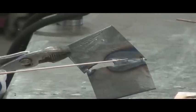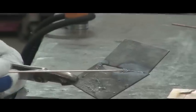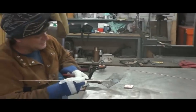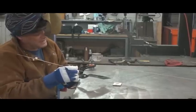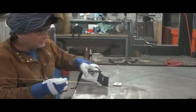See, I can start to fill this hole in here. And if you look on the back side, you can see it here. So I could come back in and grind this just a little bit, or I could even come in with the TIG and just hit it a little bit more on the back just to fill any little gaps that are there. But you can see how nice and smooth it came out on the back — no big bubble, no big glob to deal with or anything.